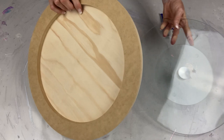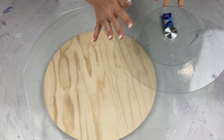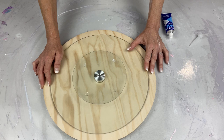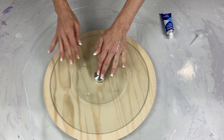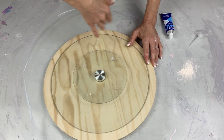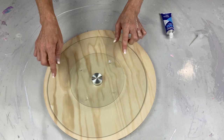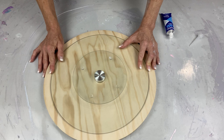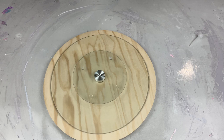Basically the board is going to be sitting on top of the lazy susan like this. To glue it, you want to turn the board over before we attach the lazy susan. This is going to be quite simple to center because we're working with a small board. If you've got a larger board, you'll need to measure in from the center to make sure the glass is going to be in the middle — because when you turn it over, you want it to spin evenly. You don't want it off center, as it will wobble out on an angle. There's about an inch of clearance around all the sides.